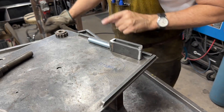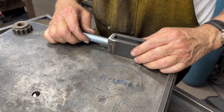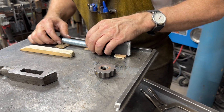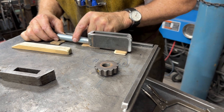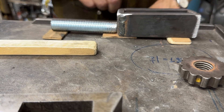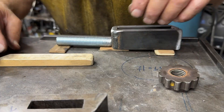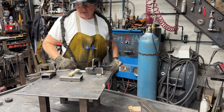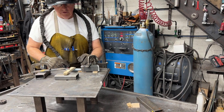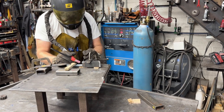I want to block this up — I don't want any current going through the threads. So I'm going to block it up with some wood. I get three shims and I'm going to go ahead and tack this. I'm going to leave a little bit of space between the front of the bending dog and the threaded rod. I decide I'm just going to TIG weld this — I don't want any chips falling into those threads. So I ground off the galvanizing on the bolt and I'm carefully going to TIG weld this.